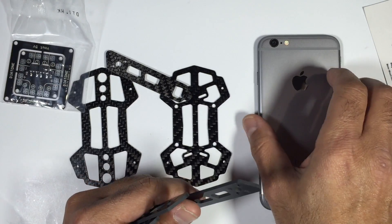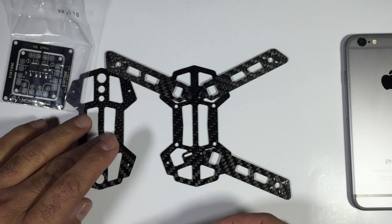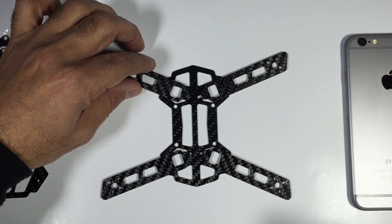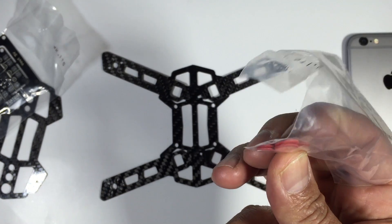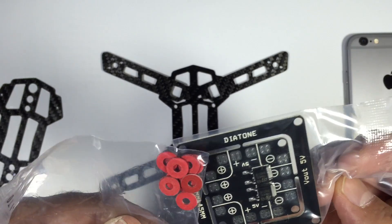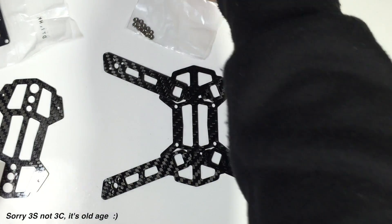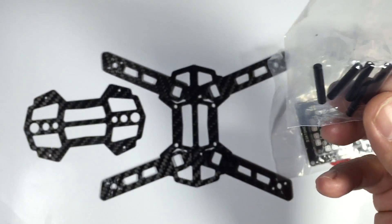Essentially the idea was to have a quad you could fly indoors around the house and in the backyard — much the same way you would with a simulator. Except this is real life, and keep in mind this is running the full gear: a Naze Air 32, D4R2 receiver, and SN20s — no compromise. The final build is running the full gear we'd typically run in any of our other multi-rotors. It's actually no compromise, a bit underpowered, but we're running 800 milliamp 30C batteries — and some 20Cs too — which aren't very powerful, but that's what we had lying around.